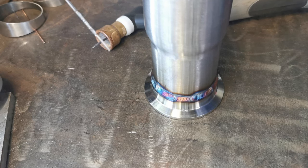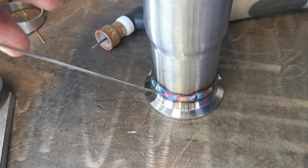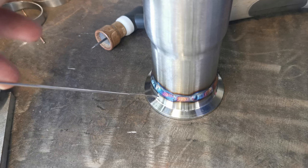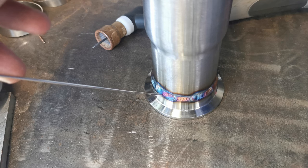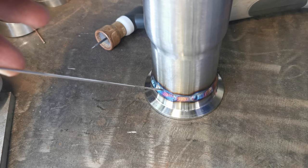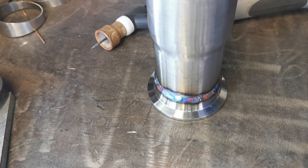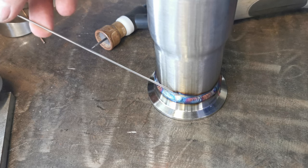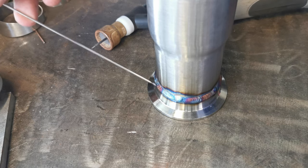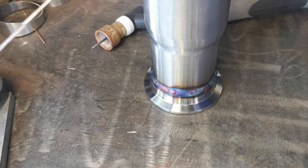V-bands are one of my favourite things to weld. When you put the V-band on, you've got a nice big lip here, so you can aim the tungsten right against this thick-walled bit of stainless here and just let it melt into the thin stuff. It's come out quite nice. I've used 1.6mm filler — probably could have used 1mm, but I'm running out of 1mm so I want to use 1.6mm in the places that I can.